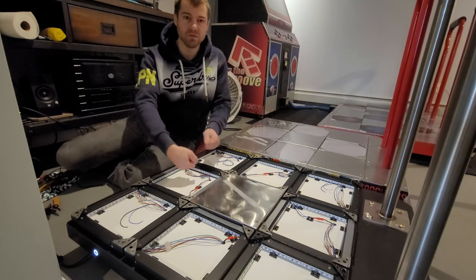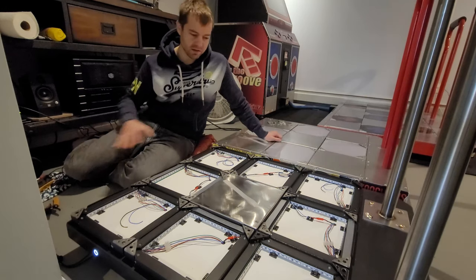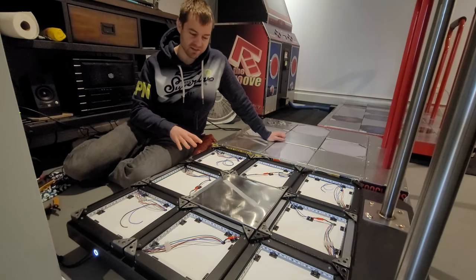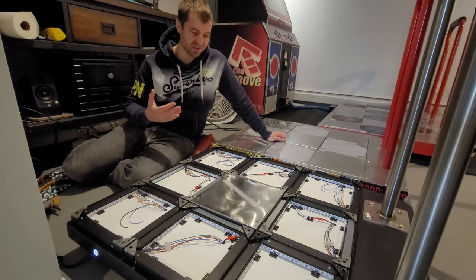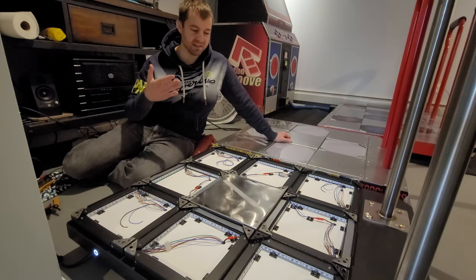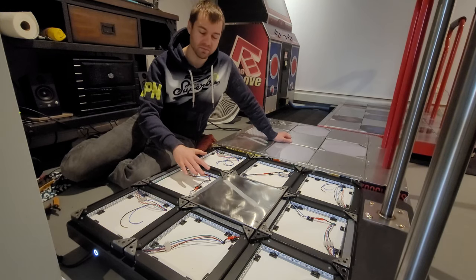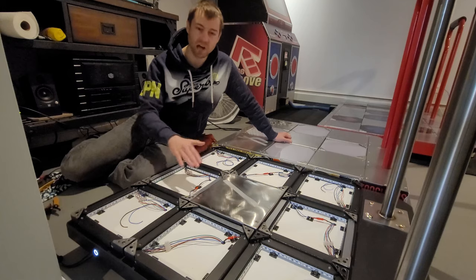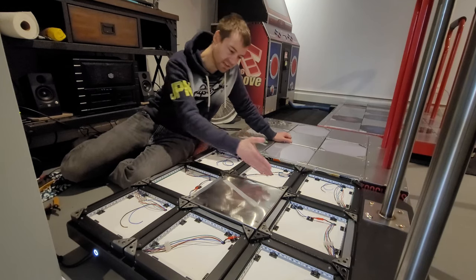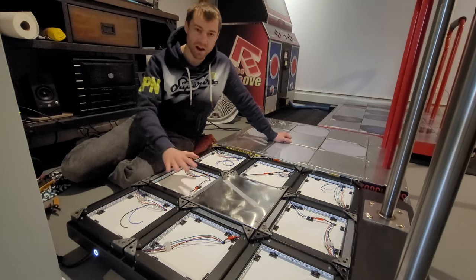So your panel can flex and bend a lot more than it would with this setup. The name of the game with FSRs, in my opinion, is to just reduce noise. You want to reduce anything that isn't this very repeatable up and down motion to your panel, right on top of the sensor. That's why you want the sensor as close to where you're going to hit it. That's why you want your panel not to move around.